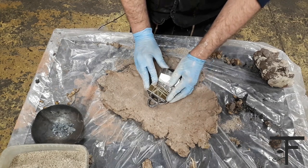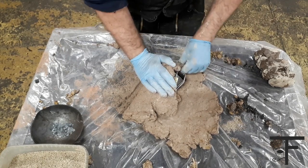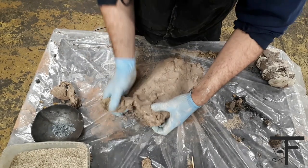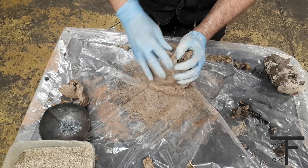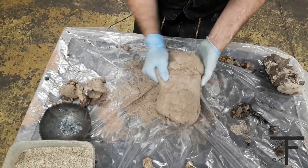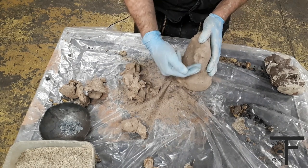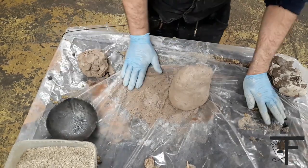Packing. So now, we put the bell there, and we pack it around. Try to keep clear of the sharp corners, and I like to take out the excess so I can put it where I want it after. Keep it so the sharp corners don't cut a hole in the clay, because that would be a break point when it dries up. Need to smooth out all the cracks. And if you do find a crack, you just wet the area, put some wet clay in it, and it's fixed. We are done here, more or less.